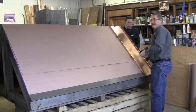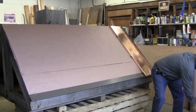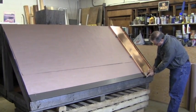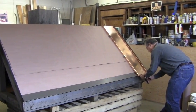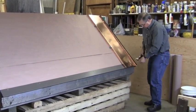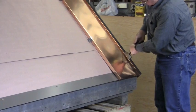Stainless steel clips hold the panels in place — they go every 16 inches. I'll take my simple hand seamers; these are three-inch, though a bigger hand seamer would be a better idea. I want to close up my bottom hem just a little bit at a time — that'll give you a nice tight seal between your eave and the metal panels. At this time you can close up your gable, your number 15 gable.